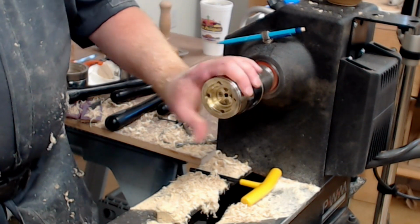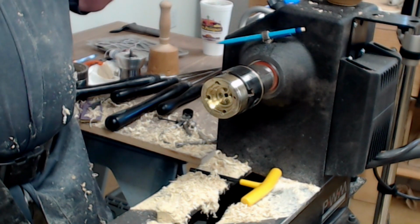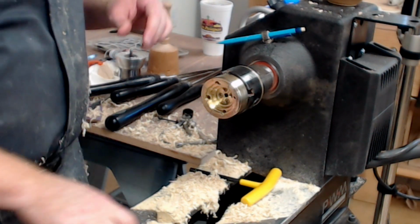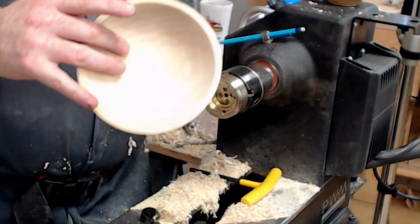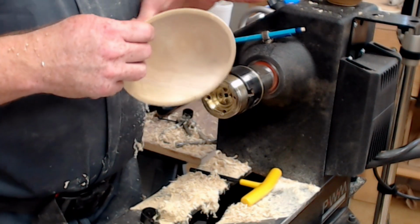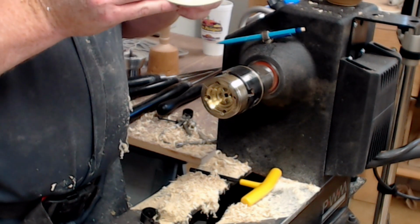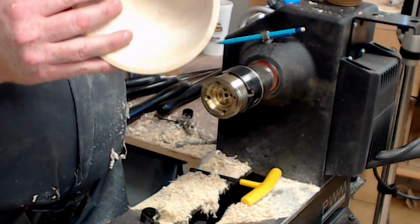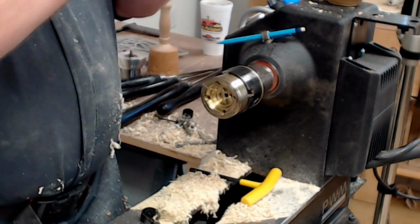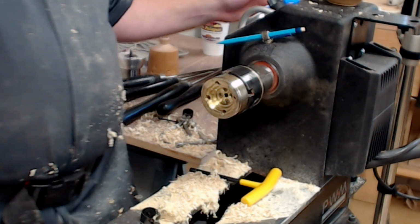But they work, and they're fine. It's just, to get a good hold, you get the stress out. You're putting stress outward on a bowl already. If there's an imperfection you didn't know about, like, I guess I cut through it. There was some discoloration here. If that had been a bark inclusion or something like that, and it was now an active outside feature, like all that lovely burl you've got, with a recess, burls have got the grain going so many different directions, whammo, it's really easy to blow it apart.